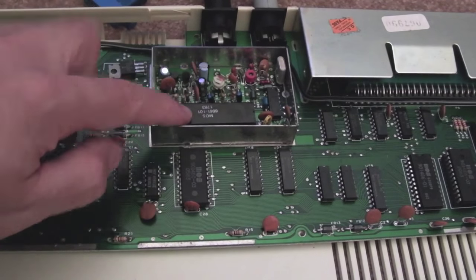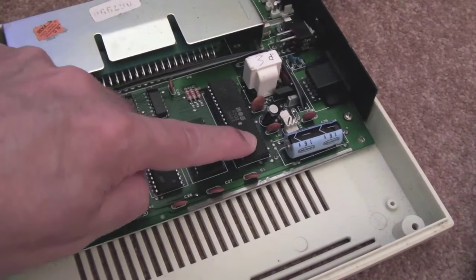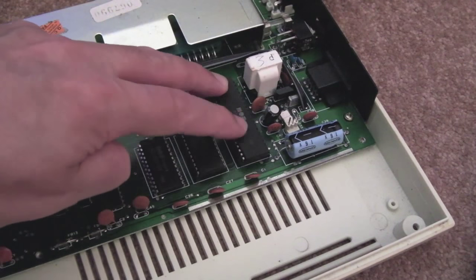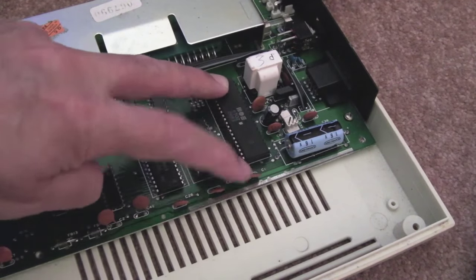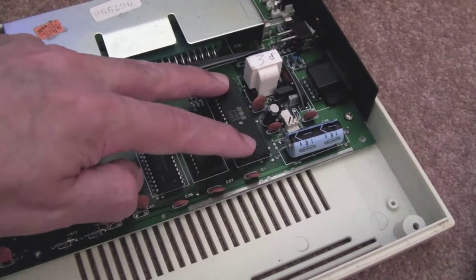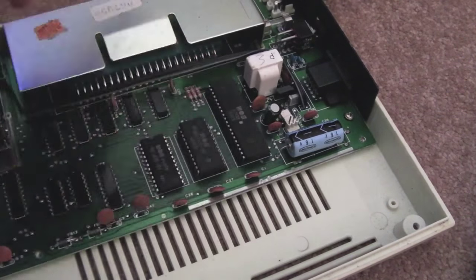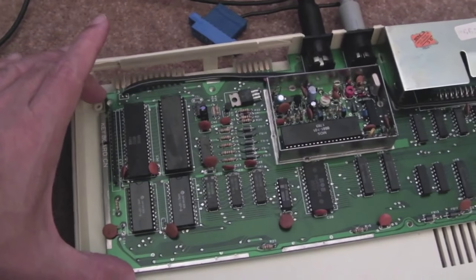I suspected right from the offset there's a problem with the VIC. Now I've got the pinouts for the 6502 CPU here — on the Vic it's the same as the C64. The only difference is there's some additional IO stuff on the 6510 in the C64, and some sort of tri-state logic on the address bus built in, so you can't just swap the chips even though the core CPU part is pretty much the same. This is one of the cost-reduced versions, which is interesting to look at.